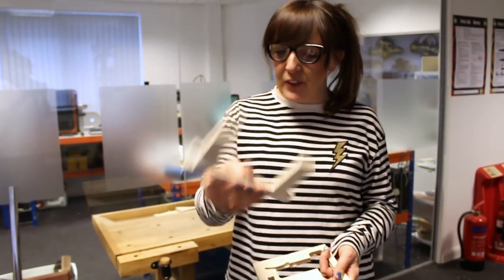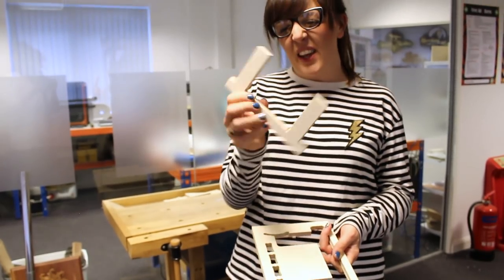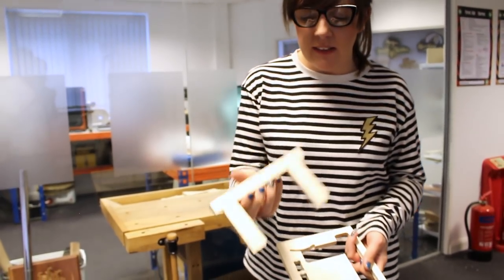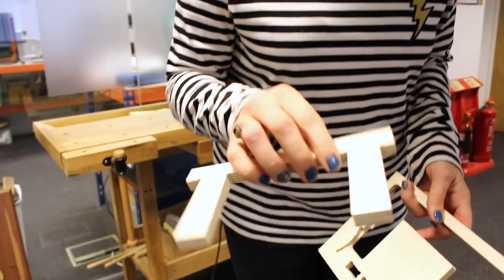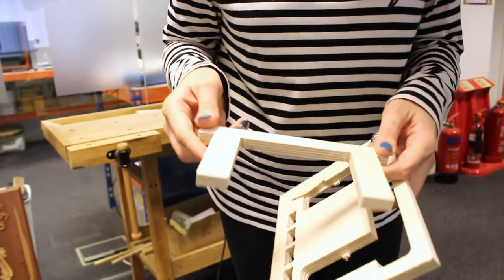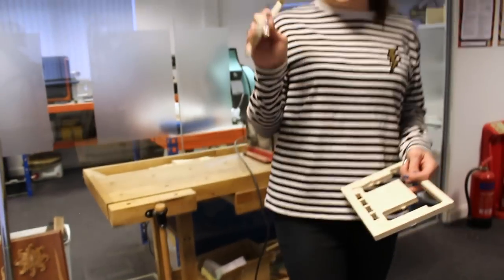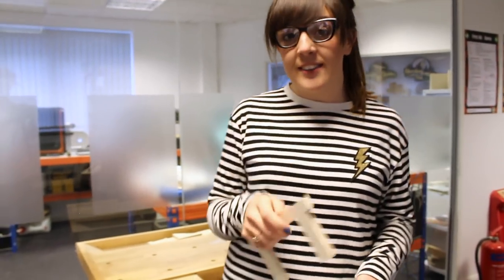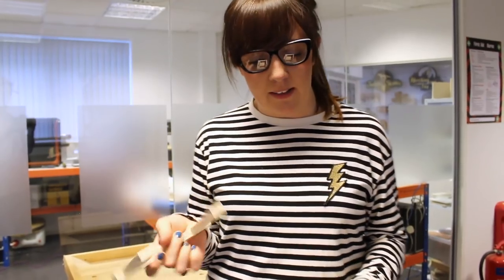And so we've got our stand piece, took it out of our parts, gave it a nice sand up, so you can see we've got a nice finish to the top side as is the bottom side, so you can see we've got no splinter in there whatsoever. And again, that's all down to the fact that we use that compression tool along with applying a ramp, a lead and a last pass allowance in our profile pass.